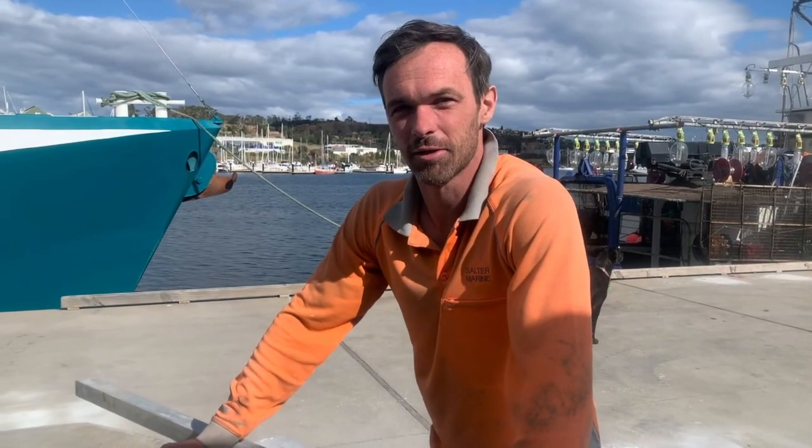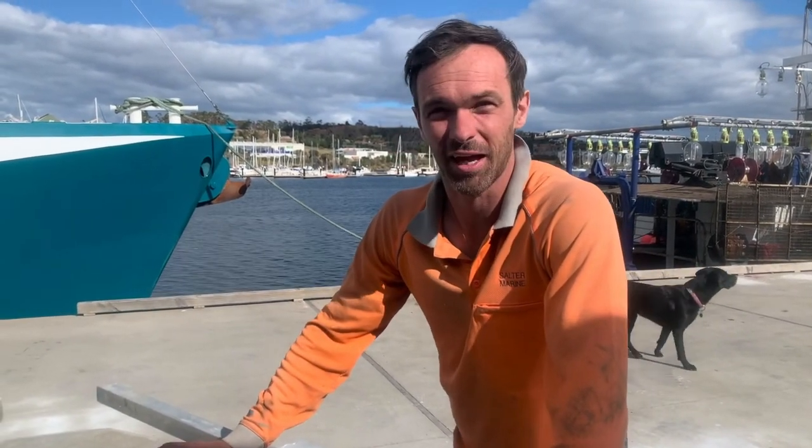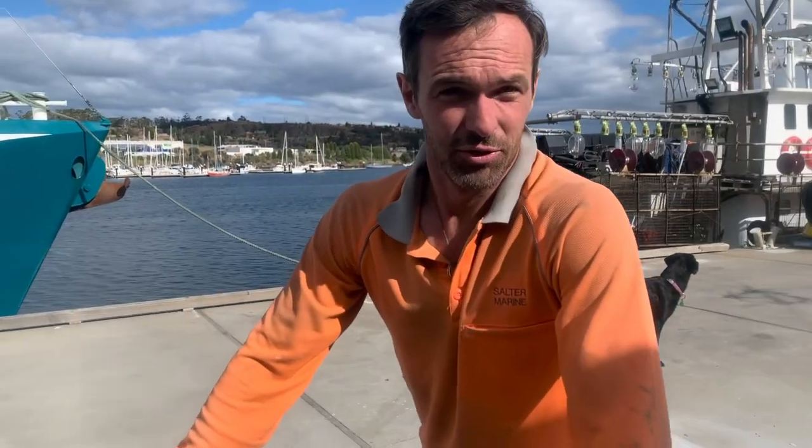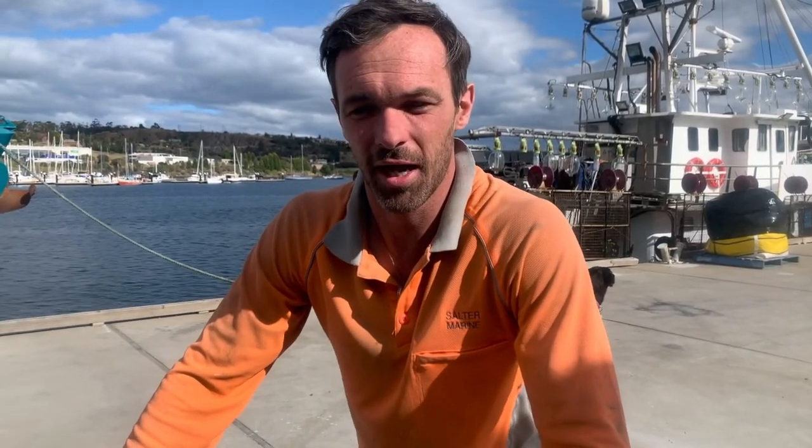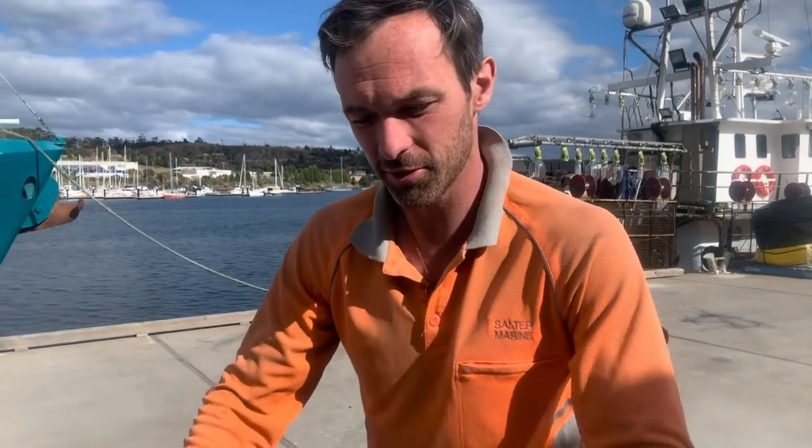So we've gone for a generous size duckboard on the back of the boat. I'm a pet hater of little pokey duckboards. To achieve this, we've started off with 2 sheets of foam that we've glued together and bent around the shape of the transom, hence why this duckboard's curved.